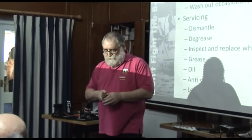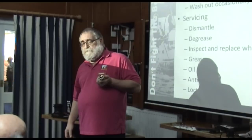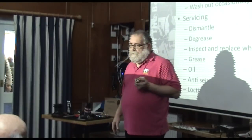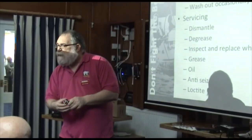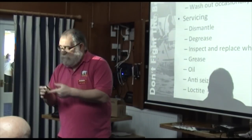We sell a winch service kit. And what's in a winch service kit? 10 pawls, 10 pawl springs. But your springs should last 5 years. When you're looking for wear around pawls, by the way, look for the size of that pocket changing. If that starts to stretch, you're going to have to replace this at some point.